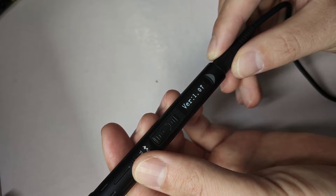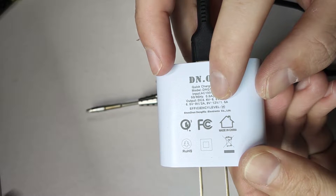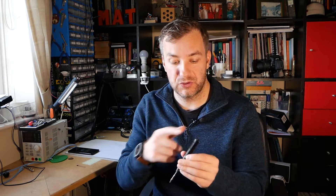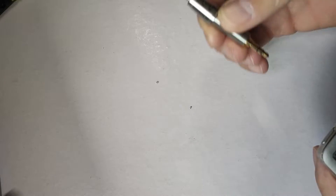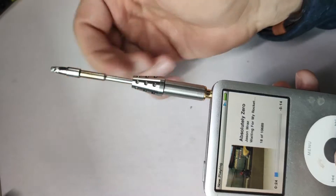The biggest difference for me between the TS-100 and TS-80 is the way you power the soldering iron. The TS-80 comes with a USB Type-C connector. While this is not USB Type-C PD supporting up to 100 watts of power delivery, it is USB Type 2.0 with Quick Charge 3.0 interface. This means while you won't be able to power it from a lot of USB sockets — because it requires 9 volts — it is much easier to power than the TS-100, which needs a barrel jack and 12 or 24 volts. The 3.5mm jack can be used with WAN devices; you can connect and calibrate it to zero. It's cold, obviously not going to melt anything.